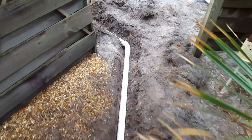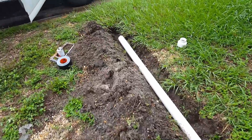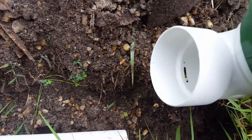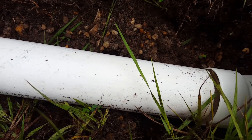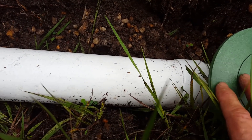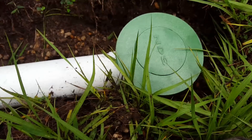The discharge line is running all the way around and out to the front — looking real good. We're getting ready to cover that up with nice two-inch pipe. I went ahead and put some three-inch on it at the end, and out here by the curb we're going to put a pop-up. I'm setting it back here because I want some of that water to disperse into the soil to help stop erosion. Out at the curb we're using a three-inch thin-wall PVC pop-up — it's available at Lowe's. You just slide it directly onto the end, wiggle it in place. I usually don't glue this because the sand and dirt hold it in place, and if you need to adjust it later it's much easier to leave it loose.